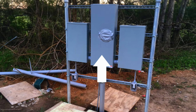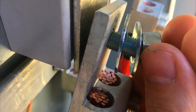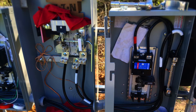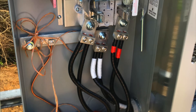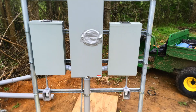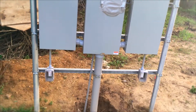Now I'm working on the meter panel in the center, installing the lugs — these are double lugs. We ran short 3-AWG conductors from the meter panel to each of the disconnects: two hots and a neutral. These are the first panels I've ever done, so I'm definitely following the torque specs. I marked my second hot leg with red tape and the neutrals with white electrical tape — once you get above a certain gauge, the wire is all black.